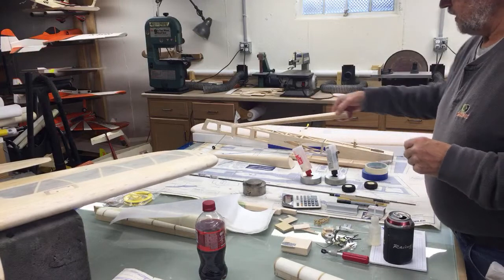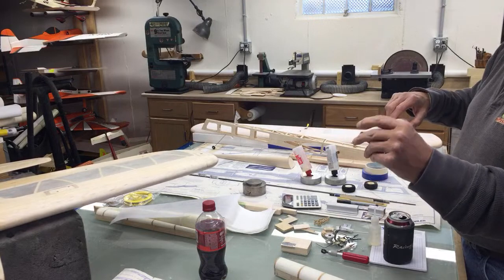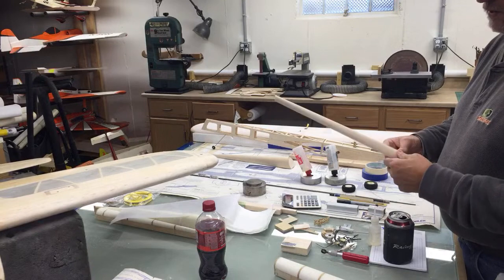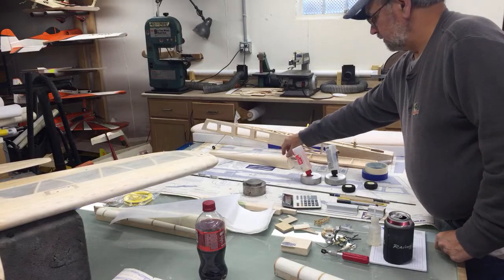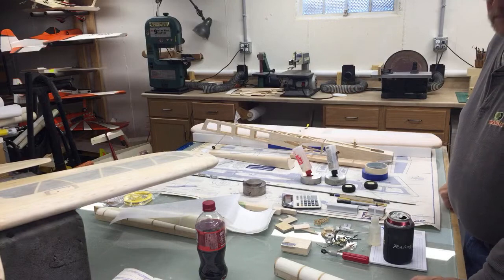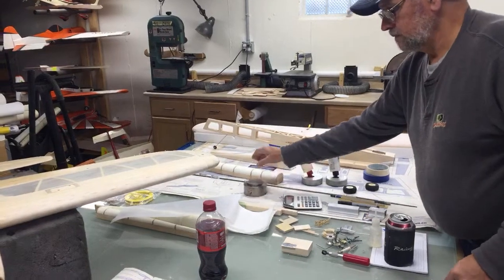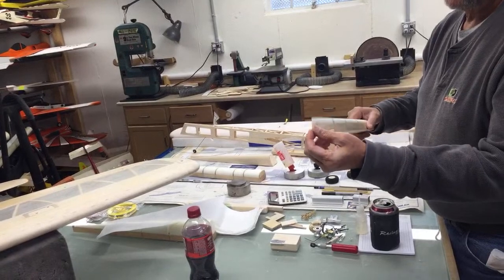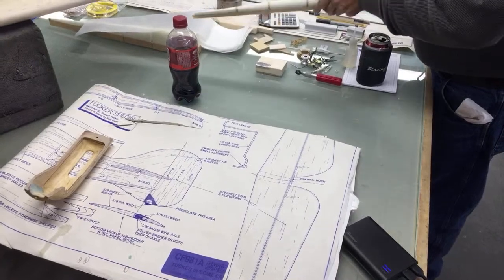And that piece actually did. I cut 3 inches off the end of that. It actually did come together at the very end of it and didn't split. And all I used was hot water and nice bendy wood. I started at the center of that mold and worked out to the ends. Just molded right on down around it. And you can see this one mold, it goes down to like nothing. A razor blade.